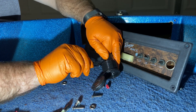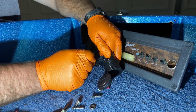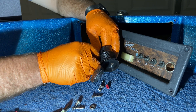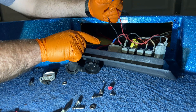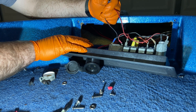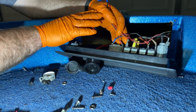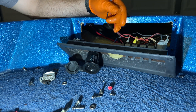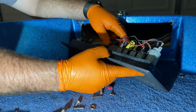This also has two set screws for the positive connection, and we're going to get those tightened up. I've got two wires here that I'm going to leave disconnected — they were run off the 12-volt battery for the old trolling motor. Since they're made for a 12-volt system, we're not going to connect them because we're now running a 24-volt system. Those were for either checking the battery supply or a cigarette lighter.